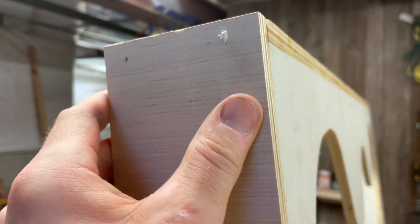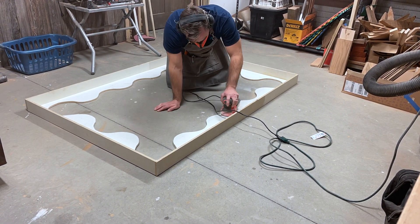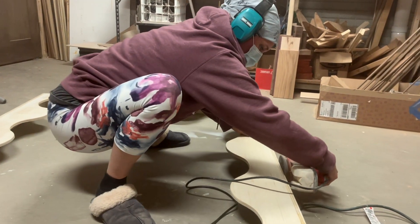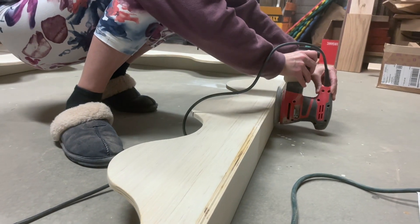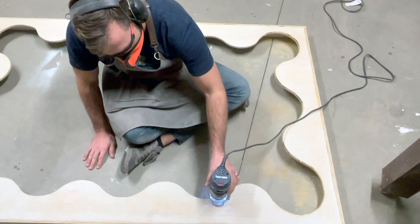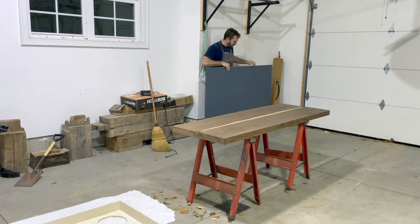Then it was a matter of closing up all the nail holes. They used a color-matched wood filler, which was really nice — you can see the holes just blend away. Now we're back to sanding, always sanding. I went ahead and went in with some 80 grit to get rid of the unevenness of the curvature. Back to sanding — look at your squats, you can squat that low? CrossFit teaches me to squat low. We went back to the round-over bit here — this made a nice even edge that we thought kind of flowed with all the curves.